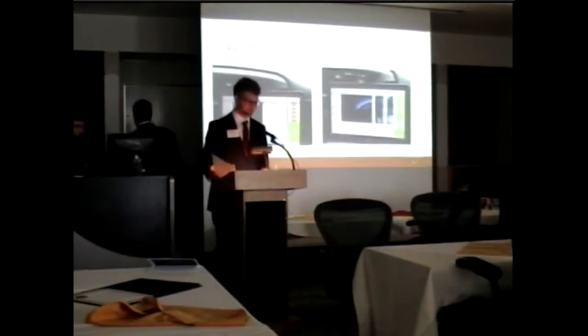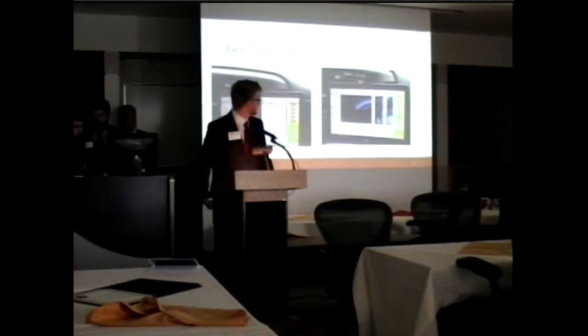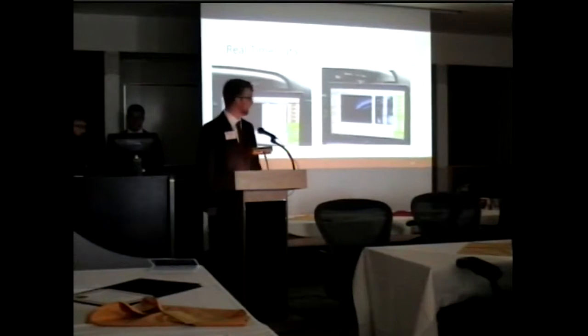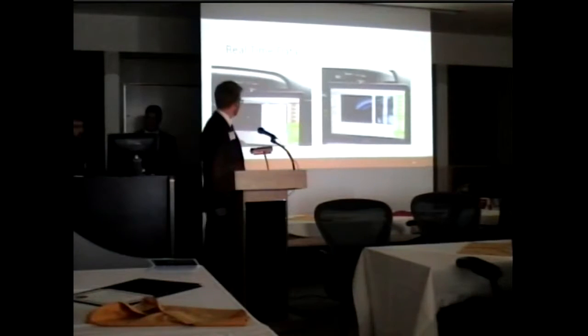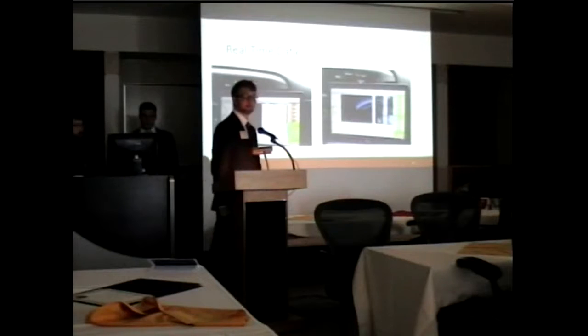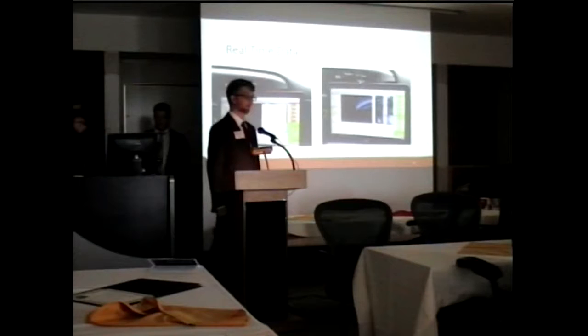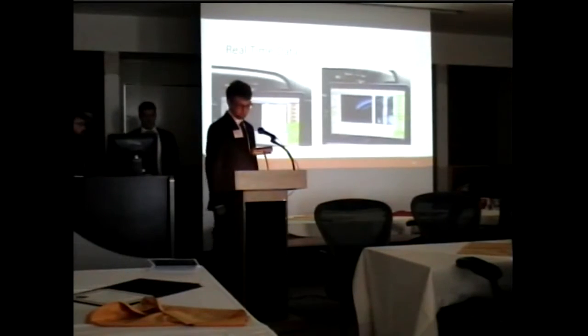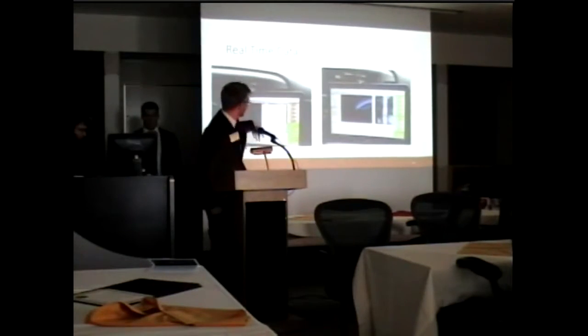All right, thanks, Mitch. This image up here is a couple of photos taken of the laptop while we were driving in real time. The image on the left is part of the calibration process, like Mitch touched on. It takes approximately 5 minutes. You just drive around, similar to the drive, either the route that you want or terrain that's somewhat similar to it. Like he said, it's linking up the IMU with the DMI and the GPS, getting everything flowing together. Once all these boxes are checked green, then you're good to go.